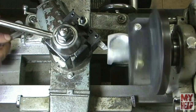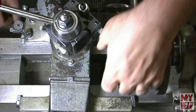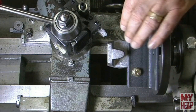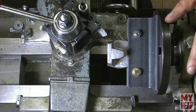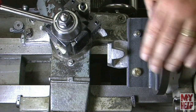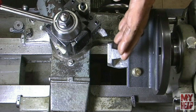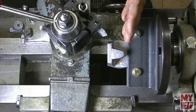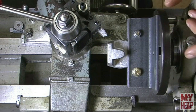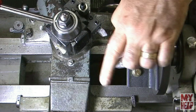I'm going to lock my carriage here. It's getting pretty close. I'm going to continue taking very light cuts because this is a precarious setup — it wouldn't take much to knock it off center, and it's the only casting I've got, so I want to be careful. Something else I want to point out: just because I'm deciding to face this off on the lathe, there are a million ways this could have been done. I could have filed it square, or milled it off. I'm a tyro — a beginning machinist — just trying to take my time and do the best I can.